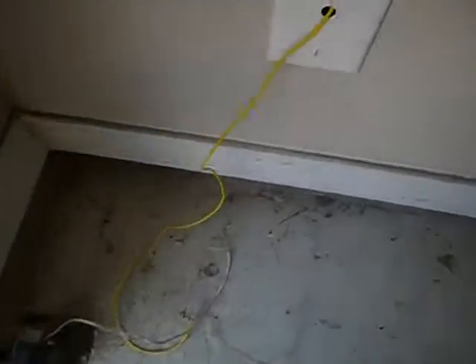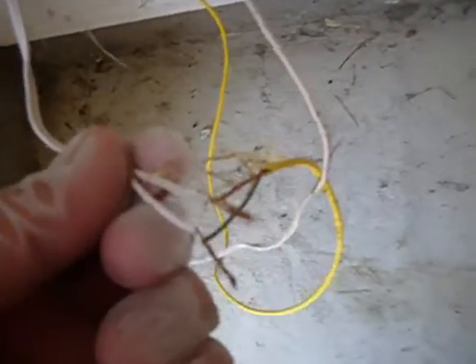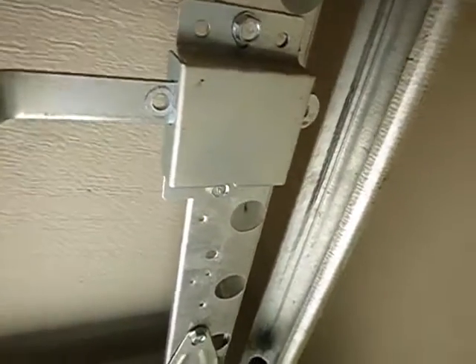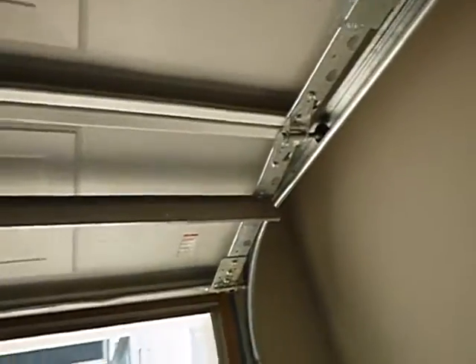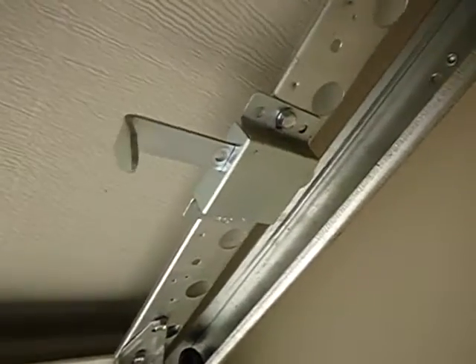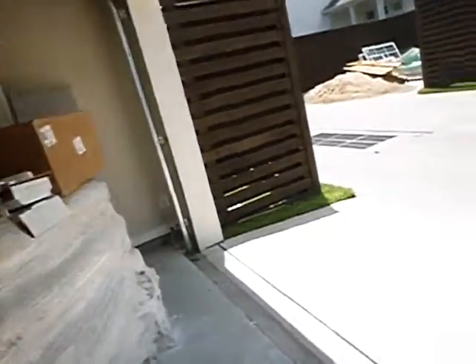The optic sensors are not supposed to be higher than six inches from the ground, and they're supposed to be secured to the wall with insulated staples. The manual door lock — it looks like they had it at one time; you can see where the screws used to be. There should be a bolt in there, because as it is now, you can lock it, push the button, and wreck your door. Since the door opener is in use, that manual lock should have been disabled.